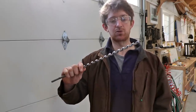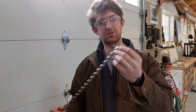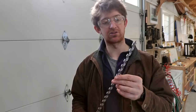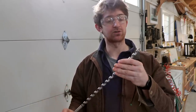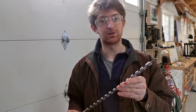So I'm about to fasten the scarves in the beam shelves, and to drill the holes for the bolts, I'm going to use this half inch auger bit. But this is an auger with a screw tip to it, and as such it pulls itself into the wood at really quite a fast rate, which is fine for softwoods, but in a very hard wood like this angelique, that's going to put a lot of torque strain on the drill bit and on the drill, and so there's a higher chance of snapping the drill bit off inside the piece of wood, which would be a real disaster.